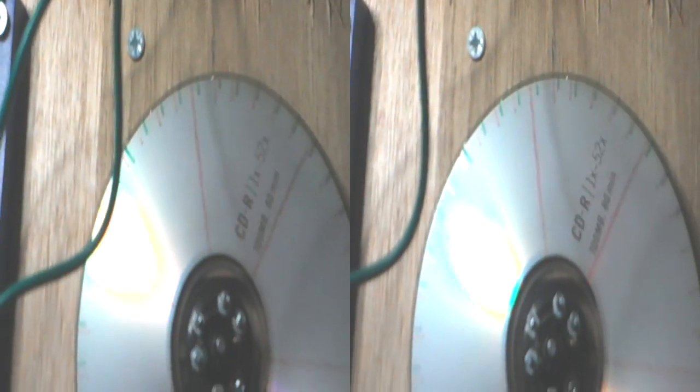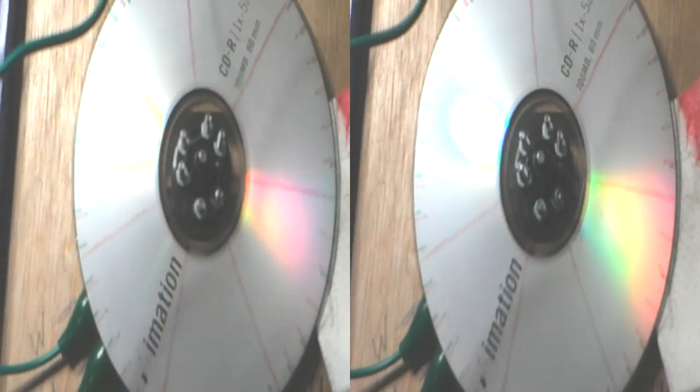So you basically have to jam something in underneath there, and it simply provides a bit of damping, effectively. In fact, that's not enough now. Jam in a bit further. There we go. You see, and so you can see that now it's a bit deadbeat. You see?